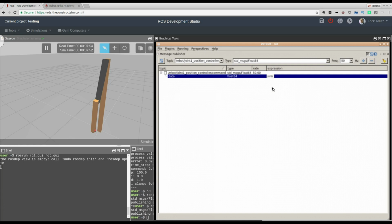So let's say i, and then divided by this, which is the rate and the speed at which we want this sinusoidal to be generated. Basically it indicates the frequency. So let's put here the same value as we have put in the frequency of the topic, and close. This indicates the frequency at which the sinusoidal is going to be oscillating.